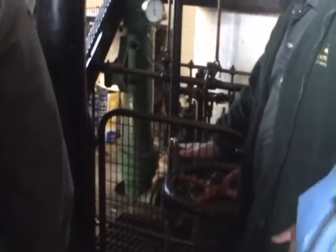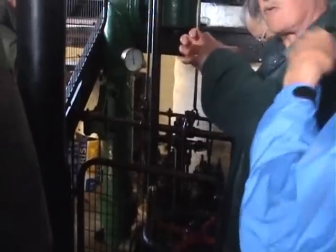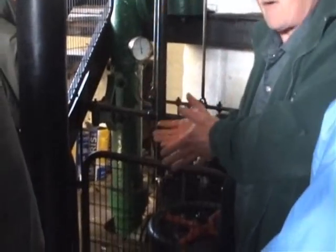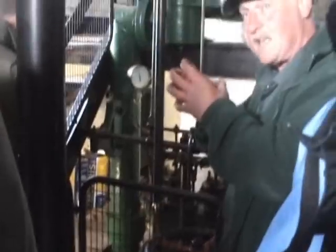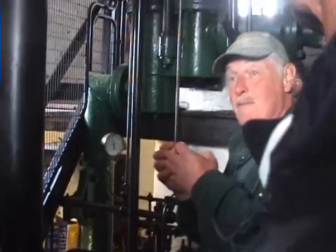What's happening down the bottom here is not pumping water - it's expelling the water we're using to create the vacuum, which is how our engine actually runs. It basically runs on steam pressure - we then condense the steam, it makes a vacuum, we then use the vacuum. So we're getting the double whammy out of the steam. That's why you don't see steam.